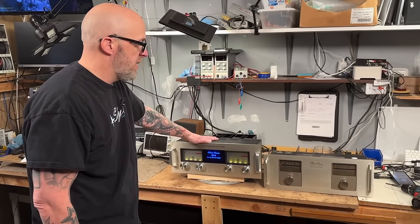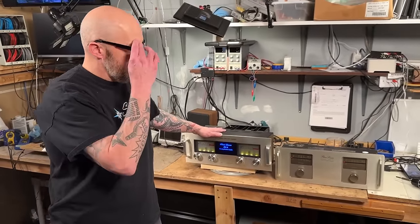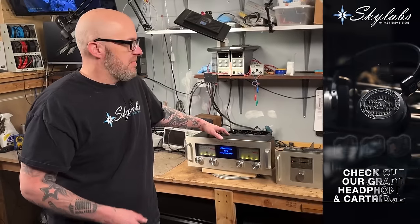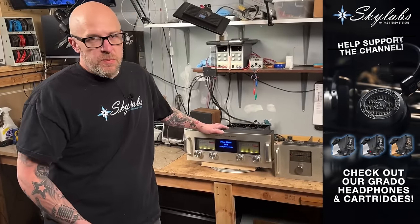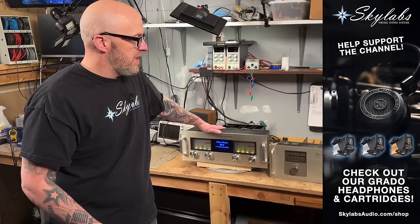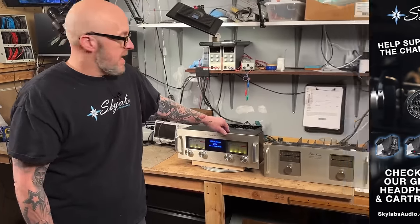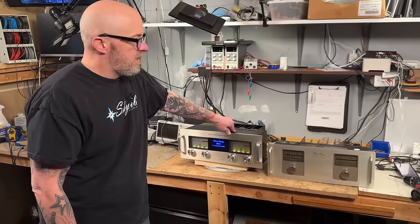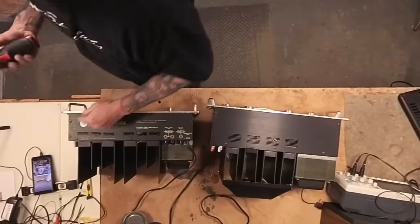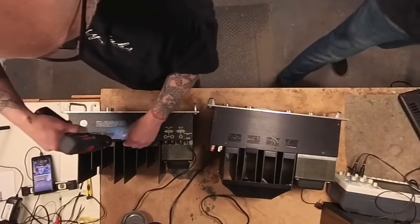Not many amps were putting out 350 watts per channel back then — this thing is a rarity. For those familiar with Bob Carver or Carver Electronics, Phase Linear is essentially Bob Carver's design. These are really well made, but Phase Linear amps from this era did have a couple of issues that earned them the nickname 'Flame Linear' — they didn't have speaker protection. Usually when we get these before we sell them, we add the speaker protection relay to make them safe to operate, and it's not a bad job.